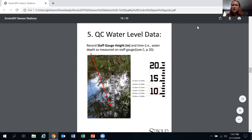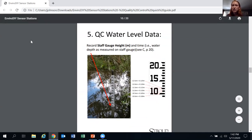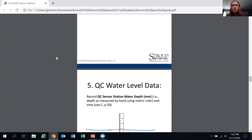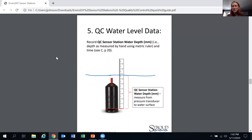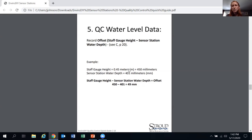For handheld measurements, use the staff gauge to QC your depth data. A great way to double-check depth accuracy is with a ruler — make sure the zero point is lined up with the pressure transducer, then measure from there to the water surface. With the staff gauge, take your reading and subtract the sensor station water depth reading from the sensor. As long as that offset number stays the same, nothing major has gone wrong with your CTD sensor.